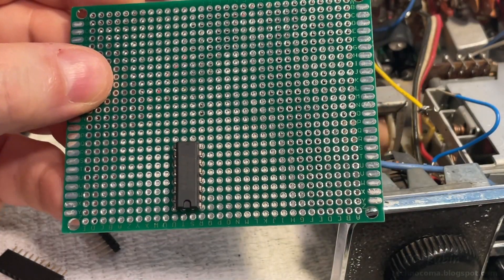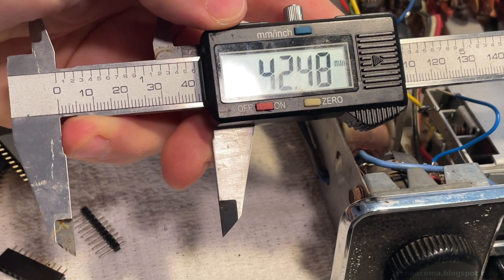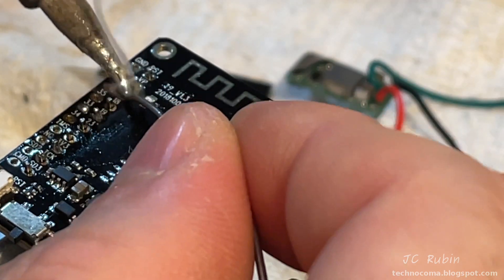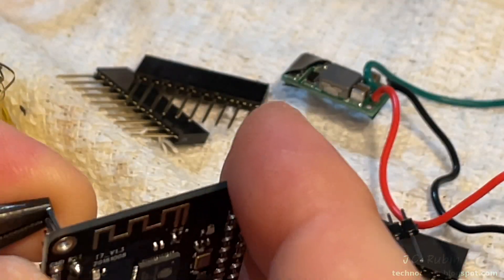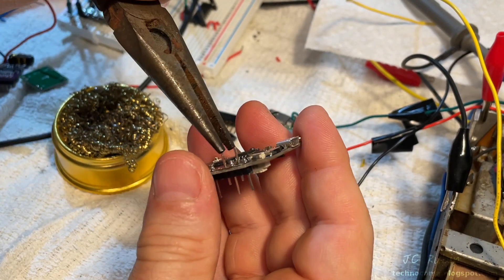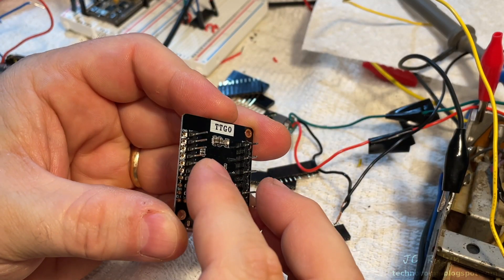Here's the board that I'll be using for this project — I haven't yet cut it down to size, just testing it for fitment. The actual chassis depth is 42.5 millimeters. I jumped into this using my old ESP32 pin out, which proved to be less than ideal. I only planned to use the pins I needed for the circuit plus some outlying pins to stabilize the board, then pull out unused pins by pushing them through and pulling them out the top. This limits how much the ESP32 comes in contact with the circuit board and other components in the radio.